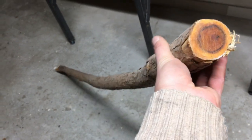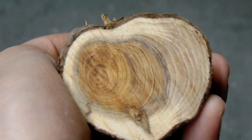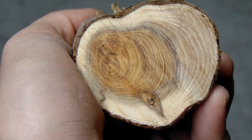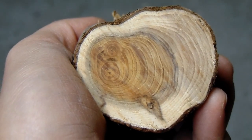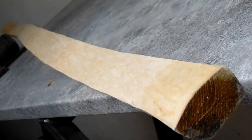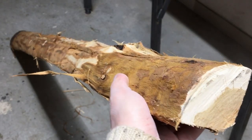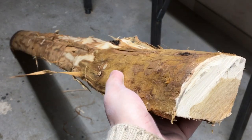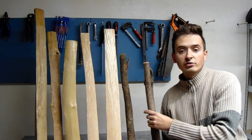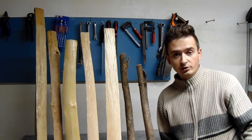Nonetheless, thin 2 to 3 inch branches or saplings can make lovely bows too, and what's more, are an easier choice for the beginner as they require less effort. What should we avoid in the bow making material? Any knots, rotten wood, curves or bumps on the trunk make the bow build more complicated or even impossible to finish. On the other hand, don't be too strict. There is no perfect wood piece out there and each one will challenge you one way or another. Picking a board, look for straight grained pieces without runoffs on the entire length.